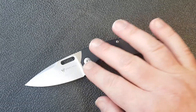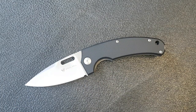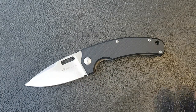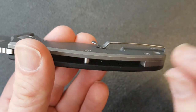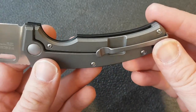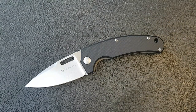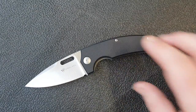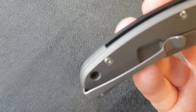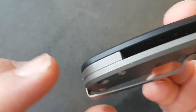Well, all the knives that I've seen that are constructed in this way have some steel inserts in and around the pivot area to make sure that there's plenty of strength. They'll have standoff screws here, so you're not screwing screws into titanium or G10. Steps are taken to make sure you're not wearing out the G10 by having metal on G10, which is kind of a fail. But in this case, everything is put together very well. It does come down quite easily. Got a backspacer here, open construction with a titanium backspacer.